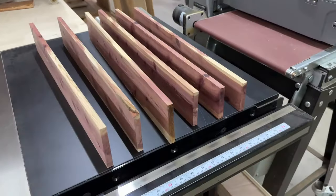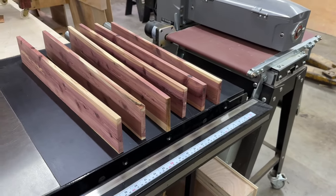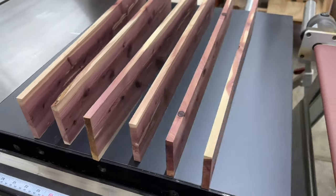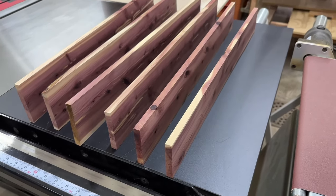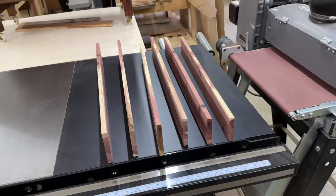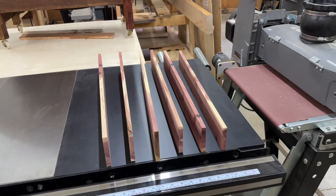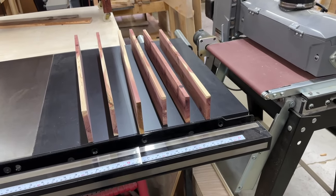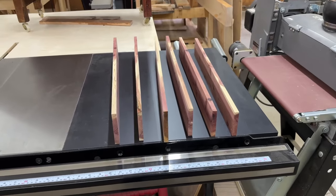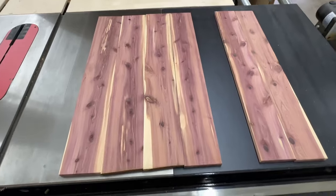So what I've got here, it's not quite 9/16, but a little over half. I got it cut down, planed down, dimensioned out. I'll set it up on the end like this and let it acclimate until I come back. We're going out of town, so it'll probably be Monday before I get back. That should be doing all the moving it's going to do, and I can take it a little further then. So they've had time to acclimate.